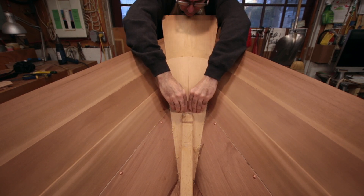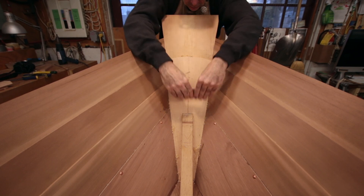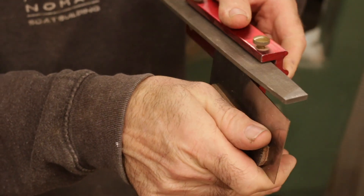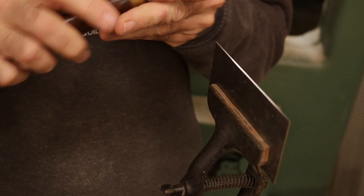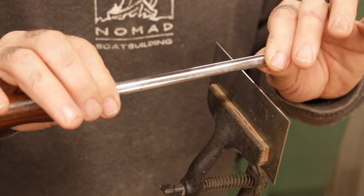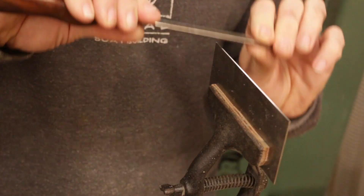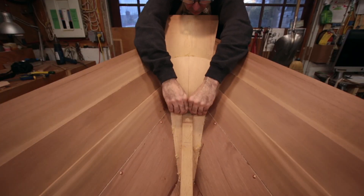If you're new to woodworking and you're trying to take it up to the next level, I really recommend you go out and get yourself a card scraper. This is the most economical and versatile tool you can possibly get. Card scrapers are almost as easy to sharpen as a pencil — just clamp them in a vise and take a file. You just want to square up that edge. Then you take a burnisher — anything that's good and hard, this happens to be carbide, but this could even be a screwdriver. Leonard Lee of Lee Valley showed me this: just use your burnisher with just a couple of fingers, that's all the pressure you need. Slowly roll a little angle onto there — start square, roll it down about three degrees. A small hook is stronger and sharper in the long run than a big hook.